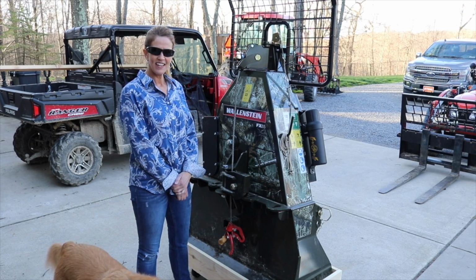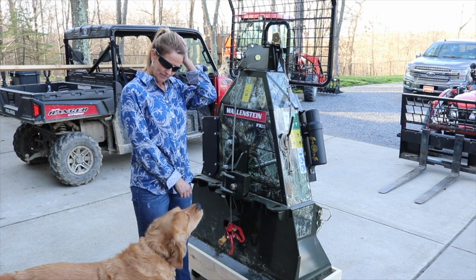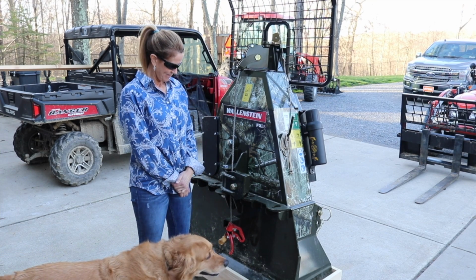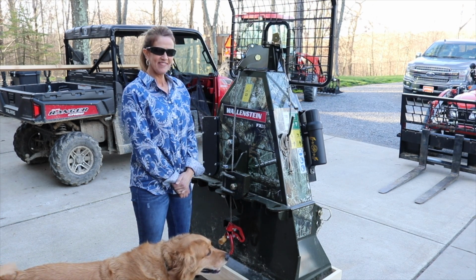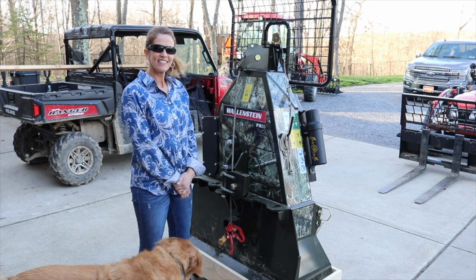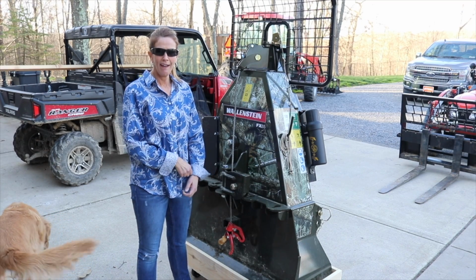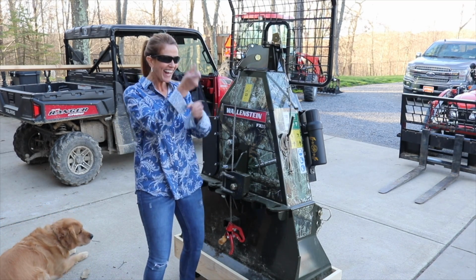And I also looked that up. It weighs 470 pounds. The platform that I made is probably 70 or 80. And the forks are probably 150 on the RK24. So it's gonna be kind of close to maxed out to lift that, but it shouldn't have any trouble. Couldn't you winch it in? Yeah, I could just hook it up and winch it right in.